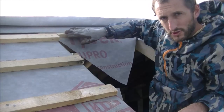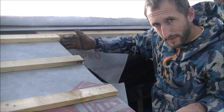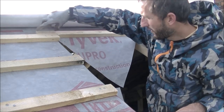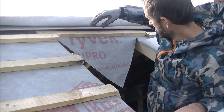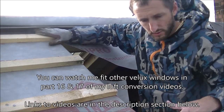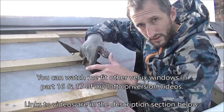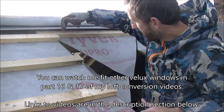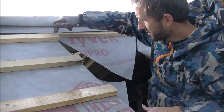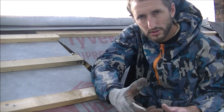So this baton I've just put in there is one that you have to put in line with the edge of your bit of frame in there. And you have to overhang that by ten centimetres each side. Then this bit is what the brackets of your frame will rest on — same down there. And then you screw down through there into the rafter, or your long section across there, and you'll have one or two screws across here. You do exactly the same at the bottom — I'm going to speed that up just to make the video a bit quicker.